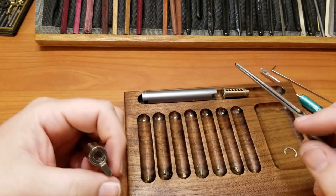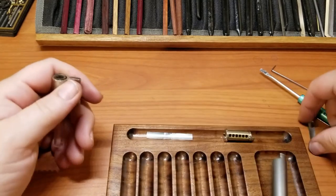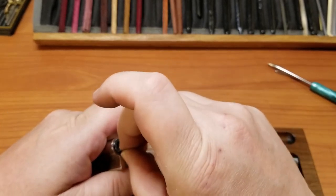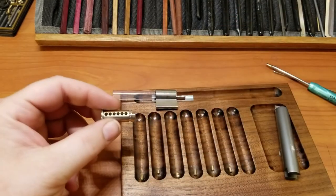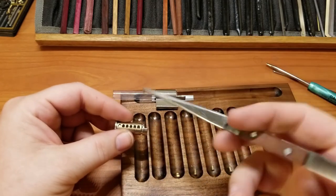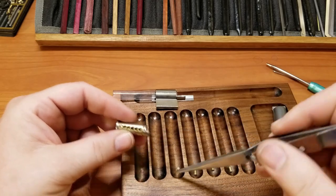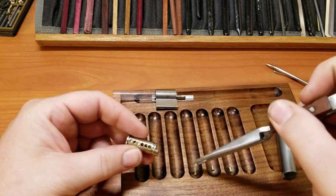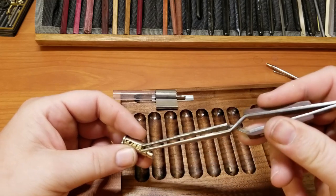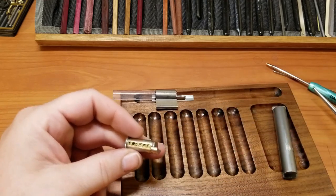And one is actually a recycled key pin, so that does tell me it's been played with some. I need my shim here. Need that when we go to put that back together. All right, let's go ahead and put these key pins back in. Okay. And there's this guy. Five wasn't actually a key pin. It was flat on both ends, so this lock's been a little bit hodgepodged.